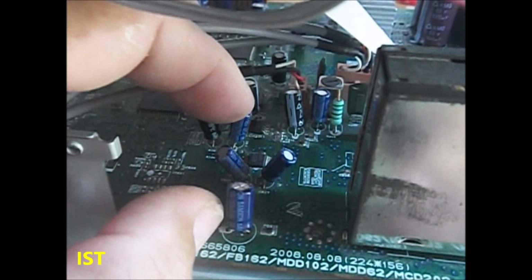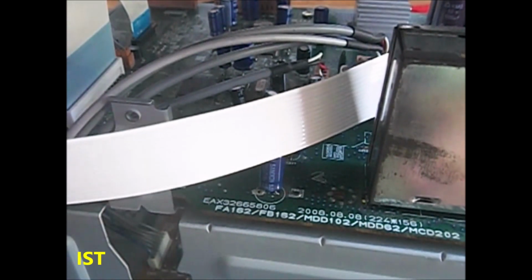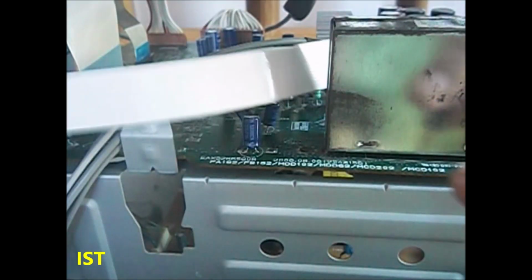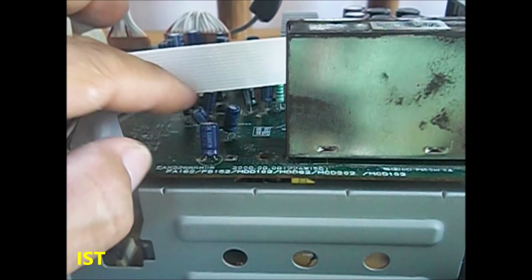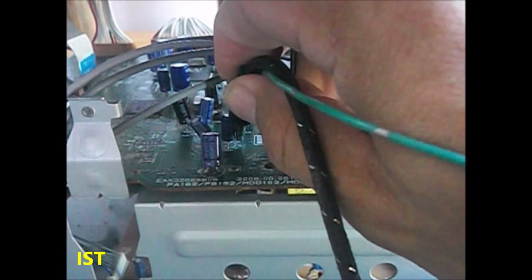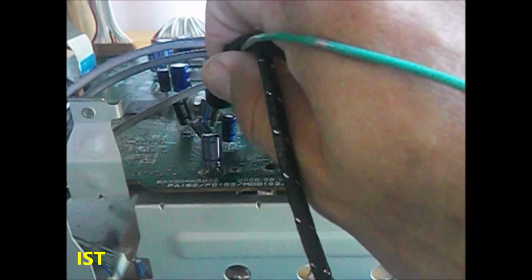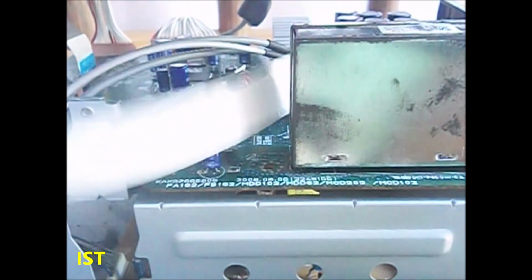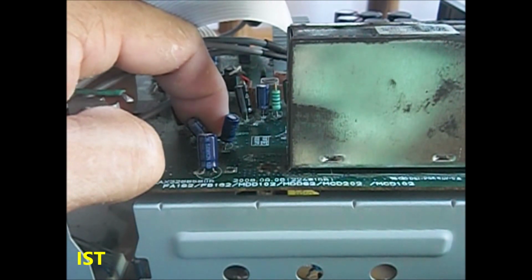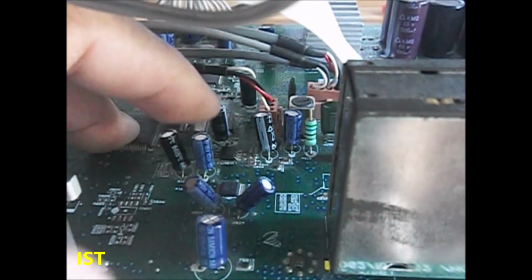So this IC is the mixer IC. The part number of this IC is 4052. So this is the demultiplexer, or in other words, the mixer IC. This unit has 5 channels generating, and this 4052 is a 4 channel mixer IC or demultiplexer. Okay, so from this area, the output of the tuner box, the signal moves to the demultiplexer 4052 IC. So we'll trace if there's a signal there. And the other channel, there you go. So the signal reaches the output of this demultiplexer 4052 IC.